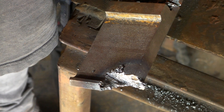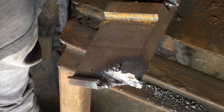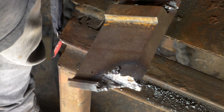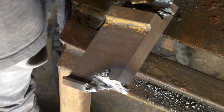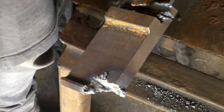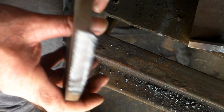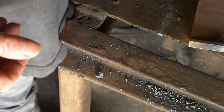As you can see guys, that is the limit of this machine. It's 40 amp, and the ones these days that you get for your workshop are 50 amp — I'd buy a 50 amp one if I was replacing this one. This is really thick and it's just at the limit of the machine. You'd get away with cutting just a little bit of it, but if you're trying to do any long cuts you'd just bugger your machine. Half inch — no worries at all, you can do a few cuts every now and then, and that's still hot.